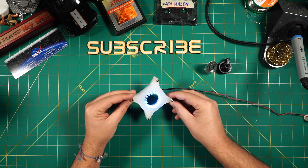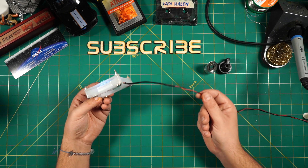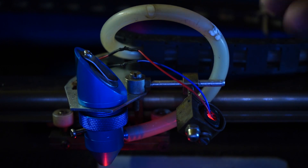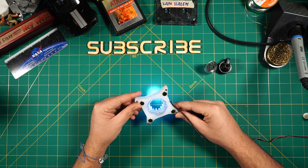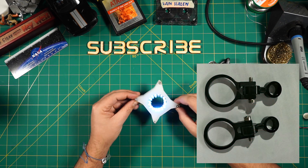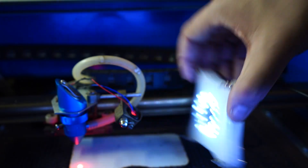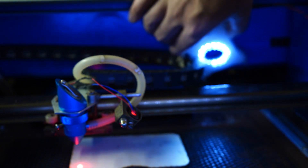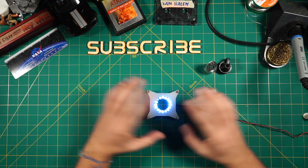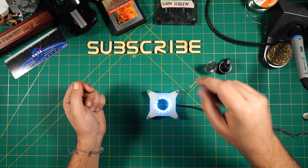Conclusion: the idea is nice but unfortunately it's not as simple and bright as you might think. The installation might look easy, but running a cable from the 5V power supply takes the same effort as running a cable to a laser diode on the sled. So it is not worth building or buying an LED targeting ring at all. I will stick with my laser dot and invest in a simple laser holder for around 15 bucks on eBay, and maybe in the future upgrade to a real beam combiner. The LED ring itself is still a nice little tool — super bright — and I use it as a movable light source inside the laser bed and around my macro lens. Even though this experiment failed, I hope you enjoyed it and we both learned something. If you like these videos, check out my laser video playlist, subscribe, and ring the bell for notifications. See ya!